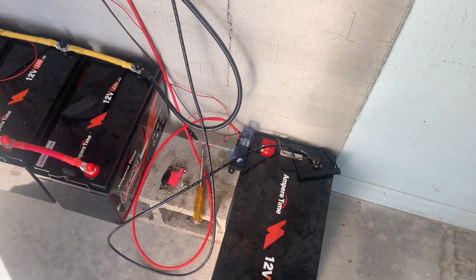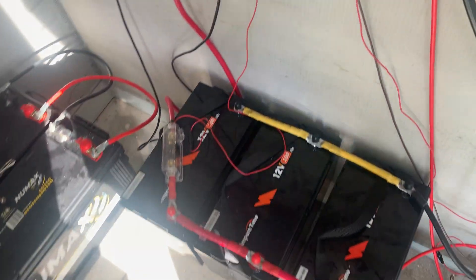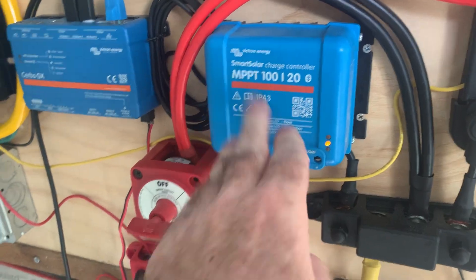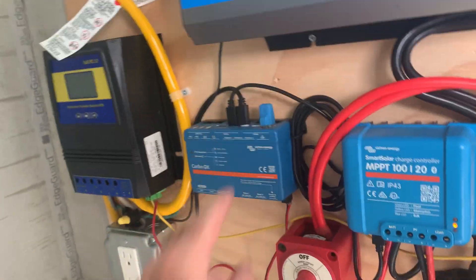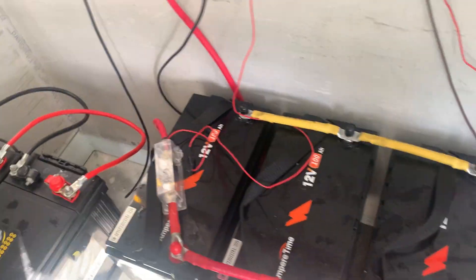This is beautiful lithium. It's now hooked up to this little controller running these guys, which is charging those lights. Charged my phone last night — saved my life. It's the only way I could keep the batteries going here, even though there was no phone service. And here's the main bank. The new bank is in, charging at 14.2. It's on the solar panel. These have all been reconfigured now for this lithium. Not bad — not bad for 9 o'clock the day after getting damn near dead.